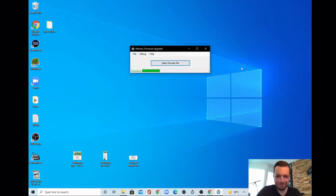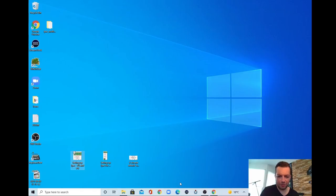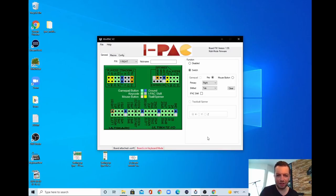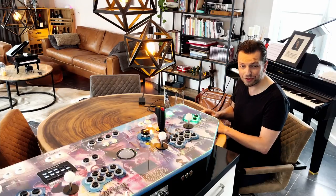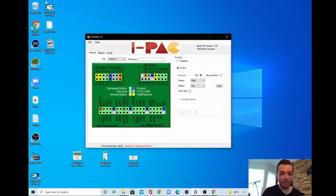It's almost done uploading. And there we are. Device is ready. IPAC Ultimate 2 is set up and ready to go. Perfect. We can close this screen and go back here. We don't need to be in administrator mode anymore. And now we can see that the board attaches as Ultimate IO board number 2. Okay, we are back in WinIPAC. We flashed the firmware. The board is now recognized as Ultimate Board number 2.